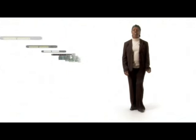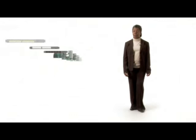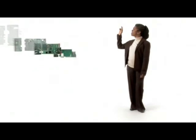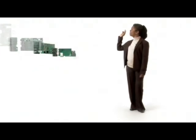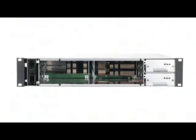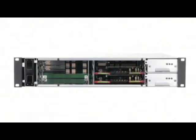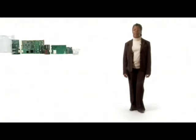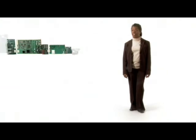Now, let's fill the frame with life. All you need is a single CPU card to run the system. Of course, you can add a second optional CPU card for redundancy. Let's take 2 of these CPU 128FG2 cards with fiber connectors. With this option, you're able to scale the system by adding frames to provide a solution for up to 1,024 users. And don't worry, even with the largest artist systems, there is no limit to the amount of simultaneous conversations.